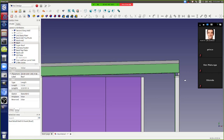You can put a lot of screws around that 100 feet. At 6 inches, you would have 200 screws. So it's 200 times 200 pounds of shear per screw, so you got 40,000 pounds of resistance just from the screws. Not to mention the hurricane ties, where I'm not sure what each one is rated for, but each one of those has to have a few hundred pounds. So it's okay at the end of the day. Yeah.